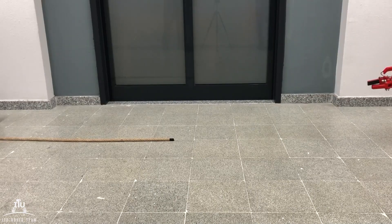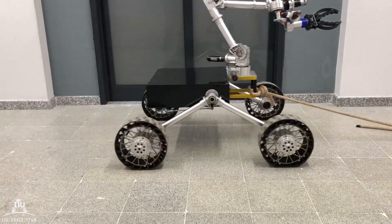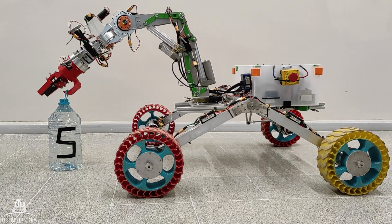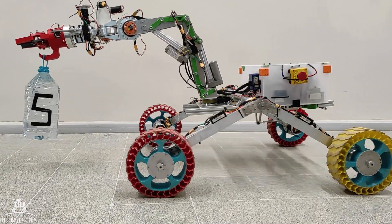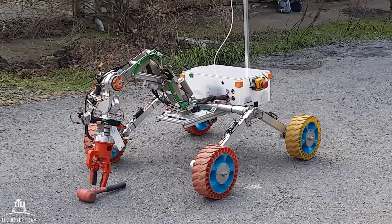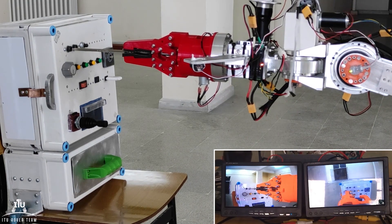According to high precision and torque requirements, a linear actuator or a cycloidal gearbox is used for each of the six axes in the robotic arm. Structural parts of the robotic arm are manufactured from aluminum and stainless steel. Cycloidal gears are manufactured from Castamide. The end effector, manufactured from PLA, has two fingers that move parallel to each other and a fixed hook to lift up to 5 kg payload. Apart from axes using linear actuators, brushed DC motors with worm gearboxes drive the other axes and end effector, controlled by the same high-powered motor drivers used on the drive system.